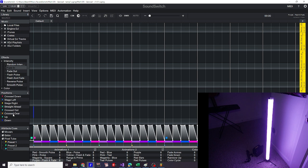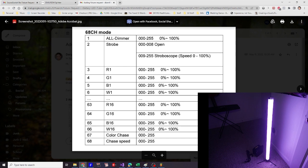The first step is to look at your manual and choose which fixture profile you want. My fixture has an 8, 20, and 68 channel profile. The difference is usually the one with more channels lets you have more control over the individual zones, and they usually won't let you trigger presets. This light is cool because it lets you trigger the presets in any of the three DMX modes, so I can manually create a cool rainbow chase or use attribute cues to access built-in presets.